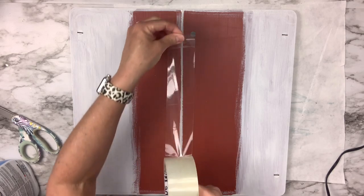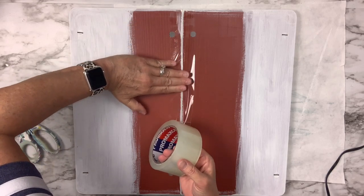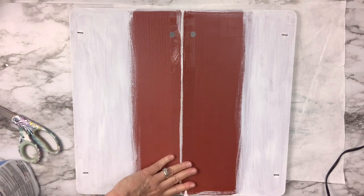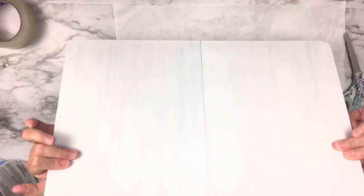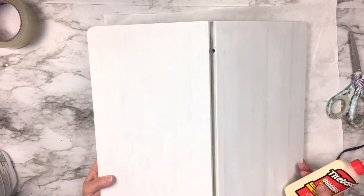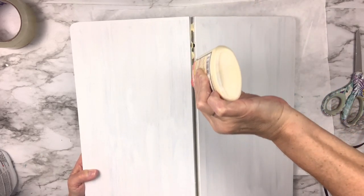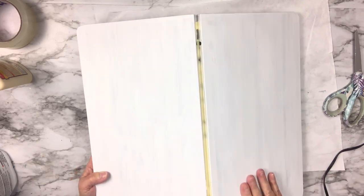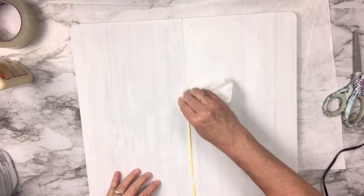Since I'm doing a clear coat over the top, it doesn't matter that it's a primer — and if you don't do too heavy a coat you can see through it, which is perfect for a slightly distressed look. To glue the two top pieces together, I start with packing tape as a hack: one piece all the way down the seam, then four little ones across, which holds everything even. Then I turn the piece over — it bends in the middle — and use Titebond Original wood glue from Amazon or Walmart. You can fold it, put the glue in, and hold the whole thing in place with one hand.